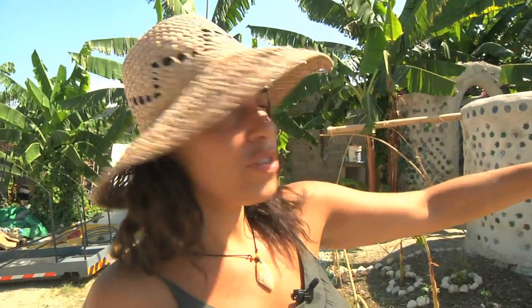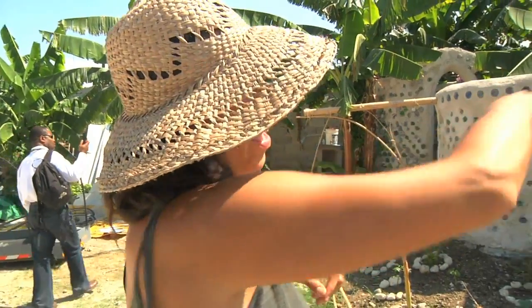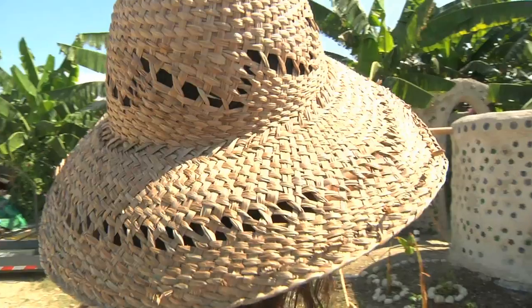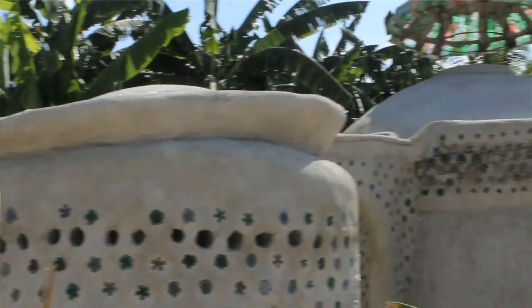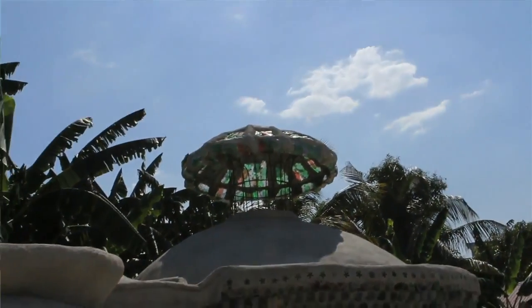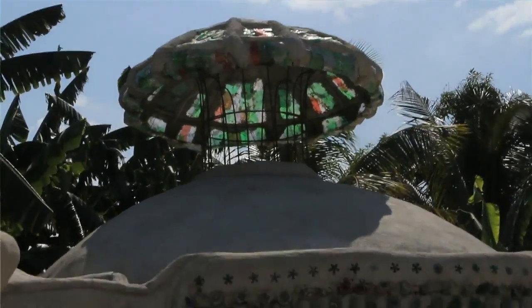Tires — if there is an earthquake, the tires are packed with dirt, they're really, really heavy, and they're stuck together. There's rebar that comes through the middle of the tires. If there's an earthquake at the worst, they'll just settle. As for roofing, we keep the roof really light — it's basically rebar domes with chicken wire and plaster, and up in the roof it's Styrofoam in rice bags. If there's an earthquake, it's very lightweight.